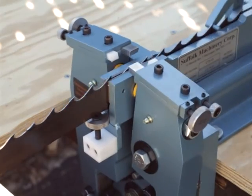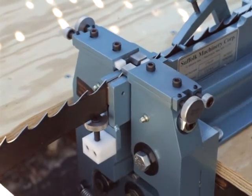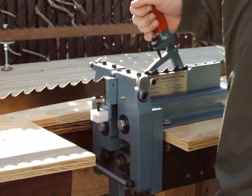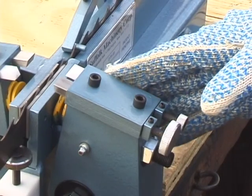The width of the setting tool bits allows you to set from 1/2 to 1 inch pitch without having to make any changes to the lateral position of the setting tool bits. If the tooth spacing is longer than 1 inch, the tooling modules must be adjusted.